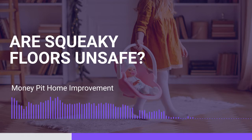I was a home inspector for 20 years, and I've never, ever in those 20 years reported squeaky floors as a structural problem. I don't think you have a lot to worry about unless you have somebody that really doesn't know what they're talking about. Sometimes if you get an inspector that is really underskilled, they will take the minute, normal occurrences of a home and turn it into a major issue. But trying to figure out why it squeaks requires you understanding which part of that floor assembly is moving, because it's evidence of movement.